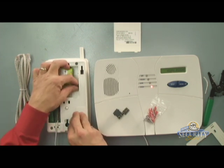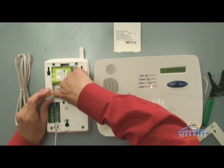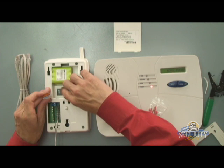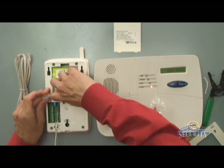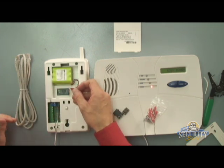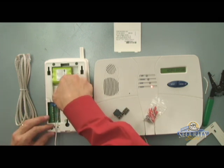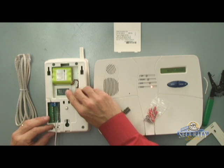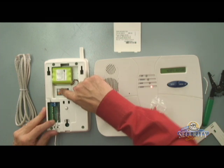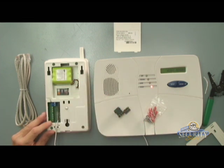Once I have my items together, don't plug in the transformer just yet, because we're going to install the SIM card here in the SIM card holder. To open this holder, just slide it back a little, then lift up gently, and place the SIM card into the holder. Press it down, and then slide it just a little bit to the left — that locks the SIM holder, preventing it from falling out.